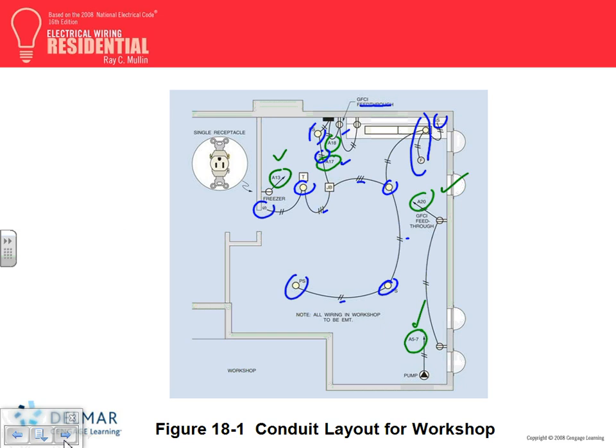That deer that you took out of season two years ago, and you're putting in that freezer now, GFCI protected, it's going to be spoiled. No exceptions. 2008, no exceptions. The only exception, if you want to hardwire this pump, buy a pump that you can hardwire, you need a disconnect for it, then you don't have to. But if it's plugged in, 120, then you have to.